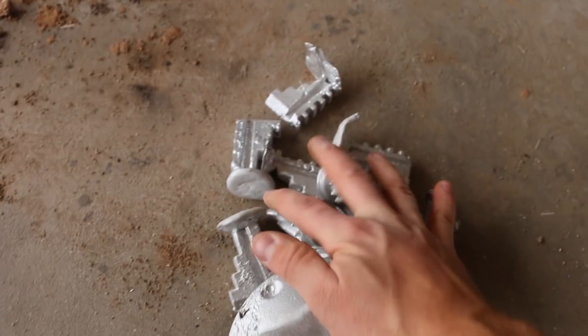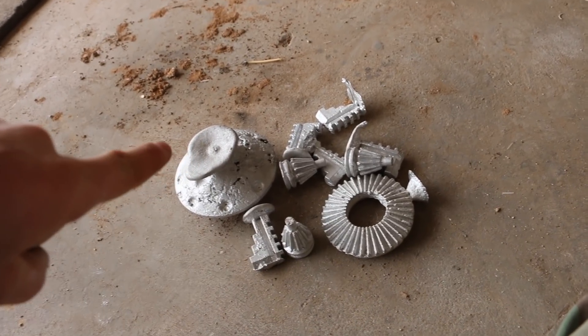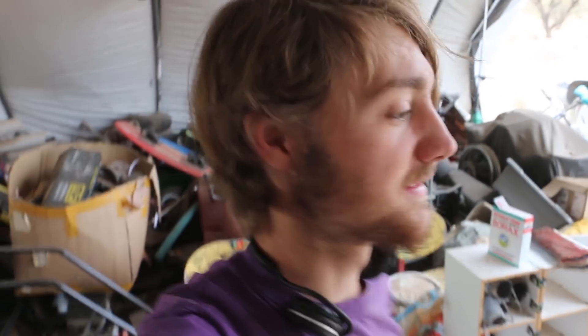I may re-cast one of these pieces, but I really like the quality of these two — they're truly phenomenal. These pinions can now be added to my pile of pieces. You can even see how these pieces work very well on this gear — look at that, they fit together so well. I've got the pinions done this episode, but we're still missing the casing that holds everything together, so we'll have to get that printed and recast. This episode was one heck of a learning curve. Having that extra chunk of metal on top worked a lot better — I'm very happy with this result. Thank you so much for suggesting preheating the molds. I'll see you in part five where we hopefully finish the casing, grind it up, put it on the lathe, and finally test it. Thanks for watching — see you next week, bye.